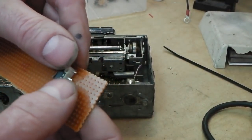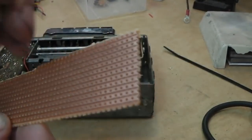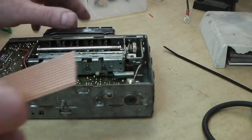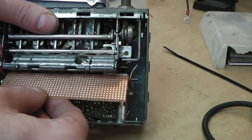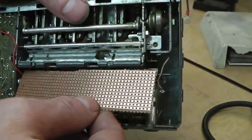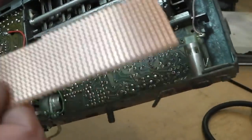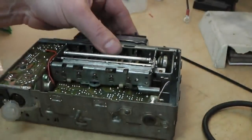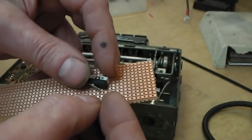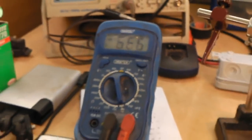We'll work with it that way up - the copper tracks here will correspond with the pins and we'll bend these pins and solder them in the exact right position so each one's spaced out just right to fit under there. We'll make ourselves a little switch board. It'll need some standoff legs - we'll find something about the right size out of plastic because we've got circuit board there - we don't want anything metal anywhere near it. I'll build you a little circuit controller - just a board with the switches on.